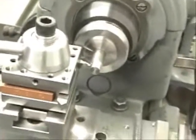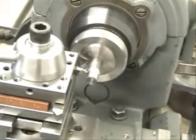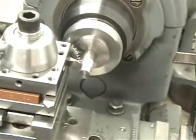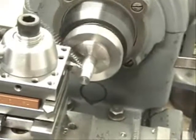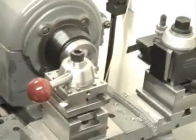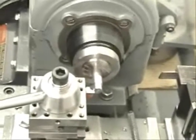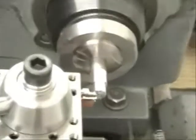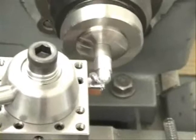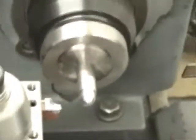I'm going to make one more cut before we change tools. Now I'm going to round over the leading edge of this piece and put a bullnose cut on it. You can see it's handling this — it's actually a quarter-inch diameter radius — and it's handling that cut very well without any chatter. Just look at the finish on that piece; that is really nice.